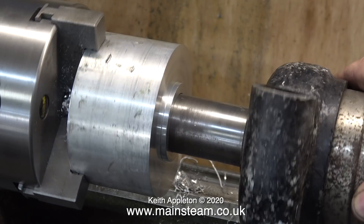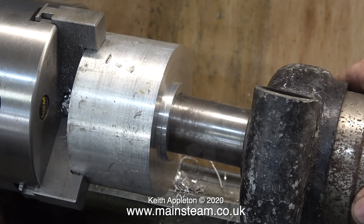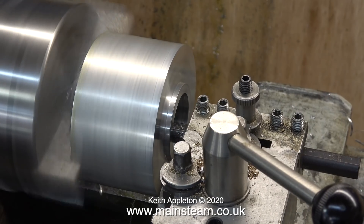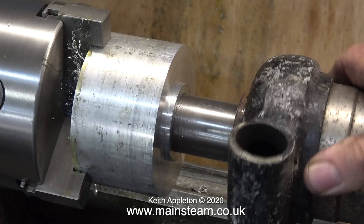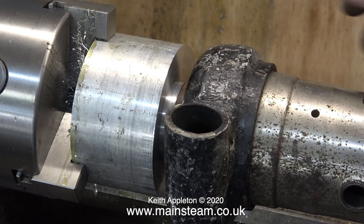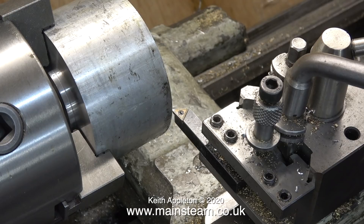During the short time that I've been explaining about health and safety, the hole in the big piece of aluminium is just about the right size. After a very fine final cut the blower fits in the aluminium block perfectly. The final part of the machining job was to turn the part round in the chuck, move the angle of the top slide a few degrees and turn a very slight taper on the piece — and this makes it much easier to fit in the top of the extension chimney.